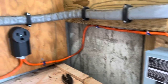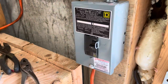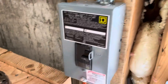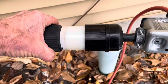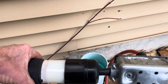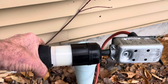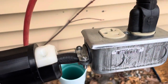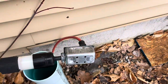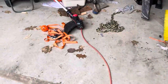So if I've got power on that outlet and I'm welding or something, I can just shut this switch off here so it won't be powered on outside. On the outside, where my wire came out, I had my 220 4-prong connector coming out of the house — a kind of strange connector because it's the male end coming out to plug into the generator. So I put a female 220 plug on there, picked up one leg of it, and put it in a service box — ta-da!